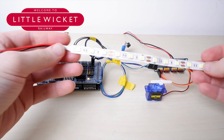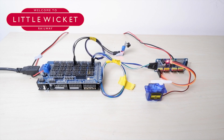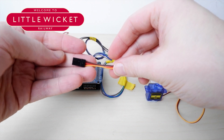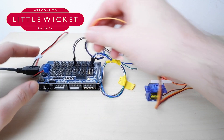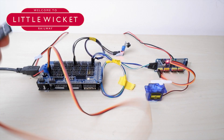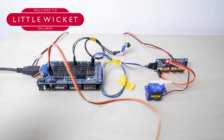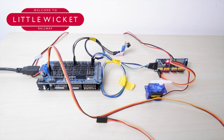So let's say I want to control this strip of LED lighting using set of pins 46 as an output. The first thing to do is plug in the normal three-wire connection — the orange wire is the signal, the red wire is plus 5 volts, and the dark color is ground. Unfortunately we can't just connect this directly to the LED lighting strip. If you were going to run a single low current LED with a resistor then the signal pin might provide enough power without overloading the Arduino. However, this LED strip runs off 12 volts and draws over 200 milliamps, and that's far too much for the Arduino to handle directly. So what we need is something in between the Arduino and the 12 volt LED circuit which will act as a switch — something that when it gets the signal from the Arduino it will switch on the LEDs — and we've got a couple of options for this.